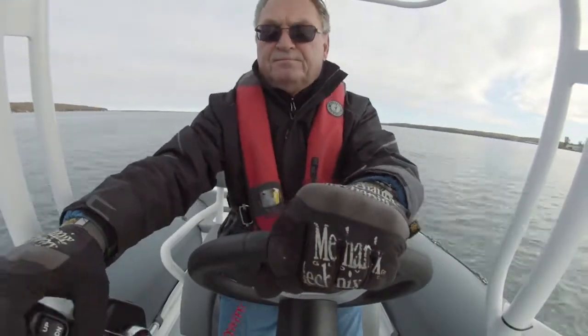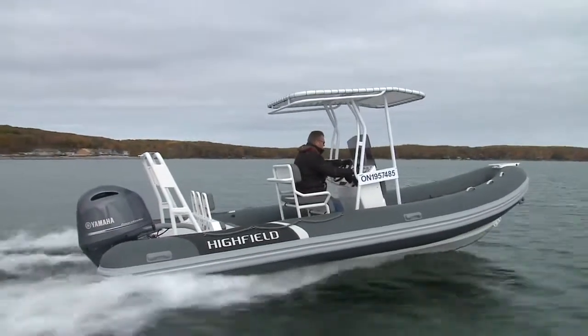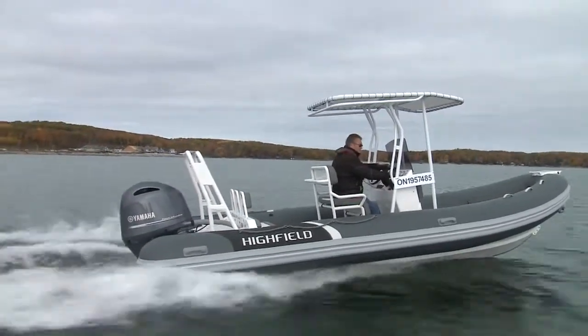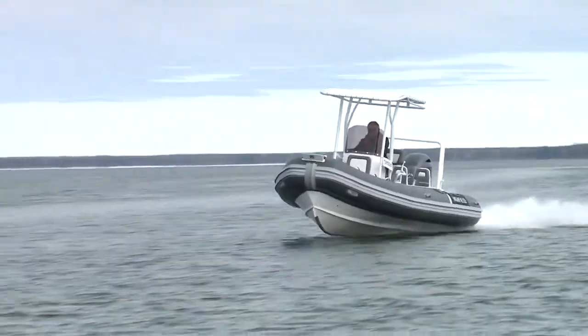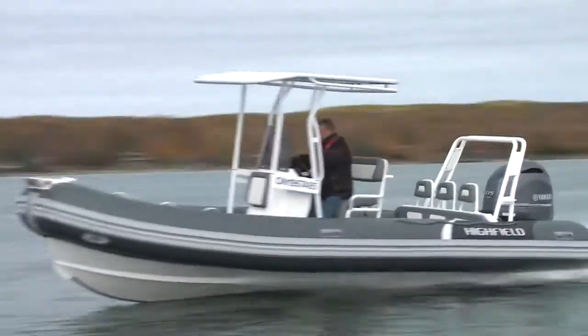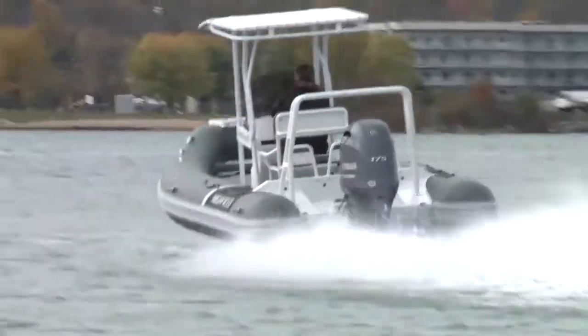The DL 640's hull is made from four millimeter thick marine grade aluminum. Unlike fiberglass hulled RIBs, the internal structure of the aluminum hull — multiple stringers and bulkheads — is stronger and lighter. All components are welded, primed with zinc chromate, then powder coated and baked. The result is a thick, hard finish that resists corrosion, scratching, and chipping.